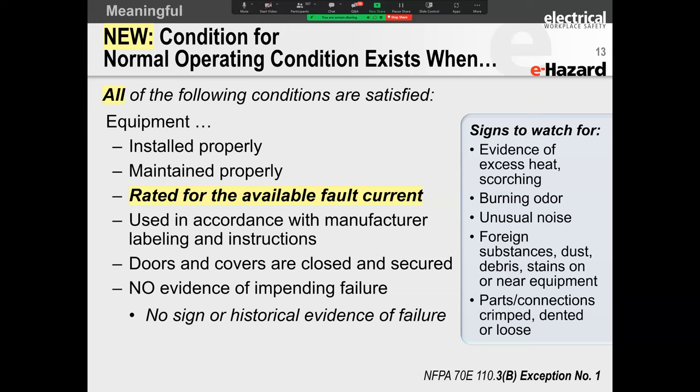But by the by, somebody came and said, hey, this transformer's old, we're removing this transformer, we're putting a new transformer in, all right? And when they put that new transformer in, because it was a higher efficiency transformer, it actually provided more fault current. So previously, when you did an arc flash study and you calculated it, let's say you were at 9,000 amps, right? And 9,000 was your fault current. After you changed the transformer, you went to, let's say, 10,500. Guess what? You have now overdutied that panel board.